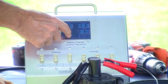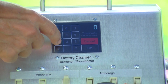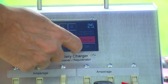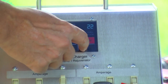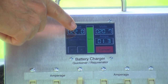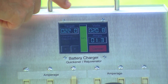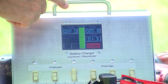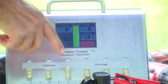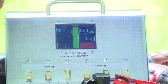You want to set the target voltage. Can you read the screen? Set up target voltage. You go about 20% above — so that's about 4 volts — making it 22. Hit Start and you see it charging. It's at 94% charge right now already, at 20 volts, 0.8 — 1.3 amps. We'll watch how fast this thing charges. I probably could have charged it at 3 amps, but we'll see. Almost 21 volts — yeah, looks like it's probably the right amperage.